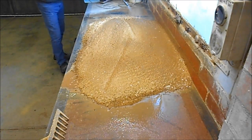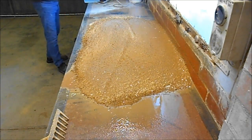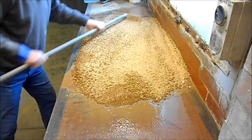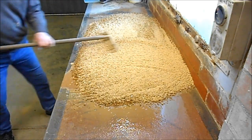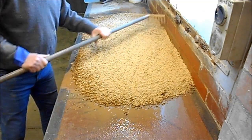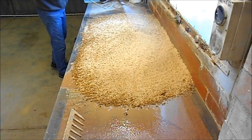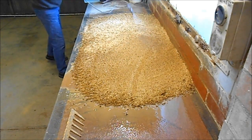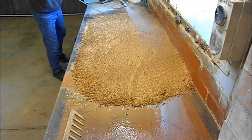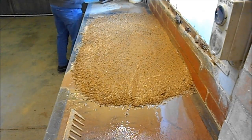Also note the volume of the sand — as more and more water goes in, the sand bulks up and that becomes quite obvious later. That too you can use as a guide to tell you when you've got something like enough water in the sand. I wouldn't be too worried about getting the water exactly right. As long as you've got enough moisture so the sand hangs together when you ram it, and not so much that it's like mud, you should be right. Dry sand tends to make brittle moulds — you get a lot of edge loss when you pull the pattern out, and bits of the mould will break away. But the surface finish will be nowhere near as good with wet sand.